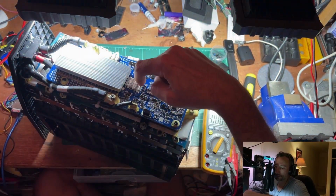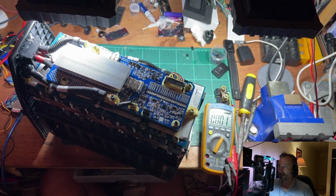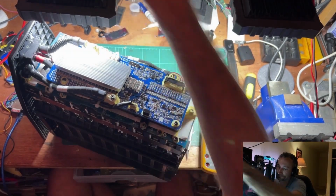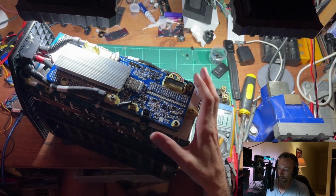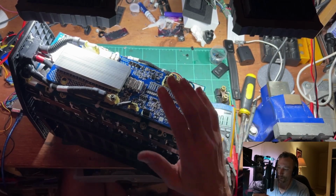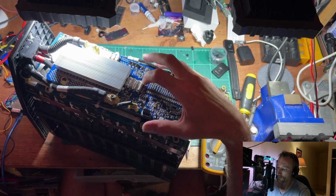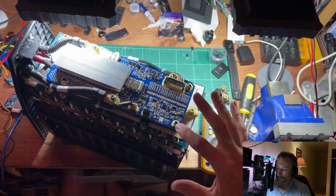More sealant in between these resistors just to hold them in place, because it's in a bike, so you're going over bumps, everything's vibrating. Yeah, might have an accident. That's the other thing. People crash their bikes all the time. This thing could be in a vehicle that has an accident at some point. Anything with mass that can move or shake loose on the board, they have paid attention to put sealant in, just so nothing can vibrate, nothing can move around.